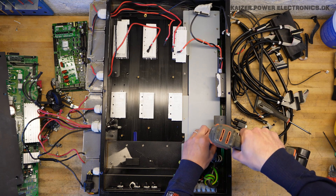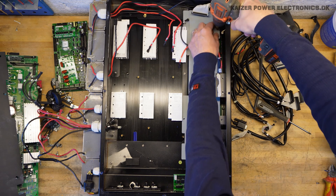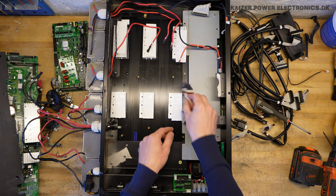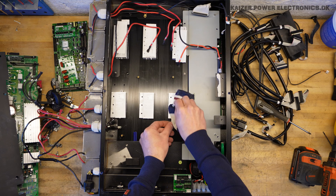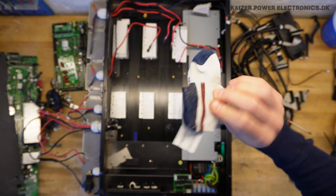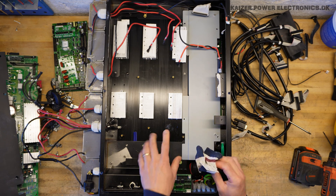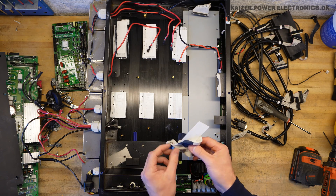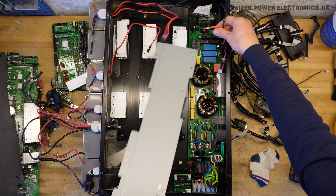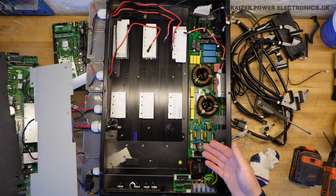Those few screws — let's get those away quickly. Before we remove that, look at those — those are actually a full ceramic plate for insulation between the heatsink and the switches. That is to insulate between the leg that goes to the back of the package, so you don't short together all your transistors. But that's a nice piece of ceramic. Now at this plate — what a filter! So the other filter was not the mains filter — that was just the solar array filter.